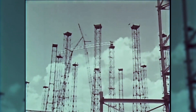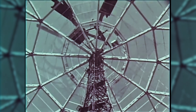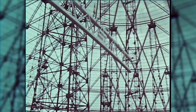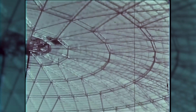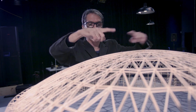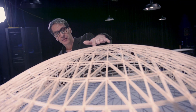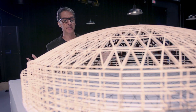There were rings of vertical towers to temporarily support the dome structure while they built it, and what was super cool was they built it from the top down. You see old photographs with one center tower and concentric rings of temporary false towers around it, and the lamella trusses grow outward over time, coming down to meet the base structure.